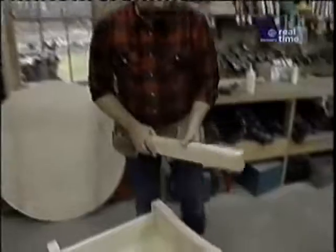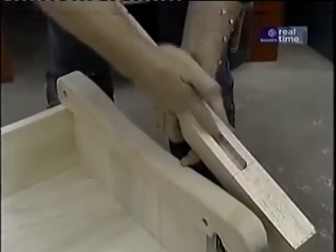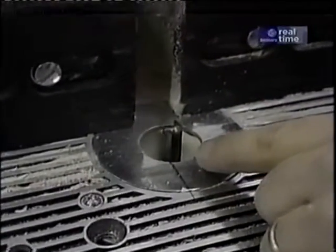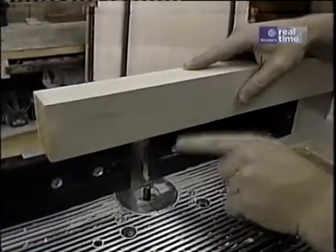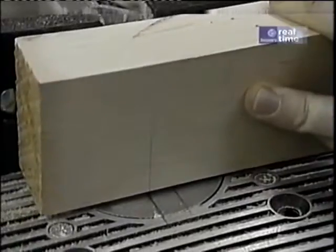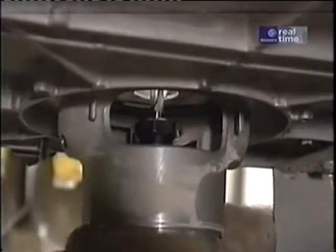To make these maple arms, I was able to get stock that was thick enough. The side is joined to the arm with a mortise and tenon, and I need to cut the mortise in the arm. I'm going to use my router table set up with a half-inch straight cutting bit. I've marked the table to show the thickness of the bit and marked the piece of wood to show the limits of the mortise. This is real hardwood, so I'm only going to take a little bit at a time until I get to the one-inch depth. Then I'll raise the router up a little bit to cut the mortise deeper.